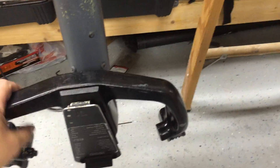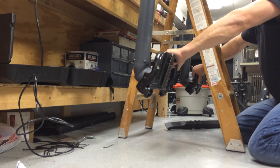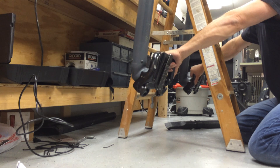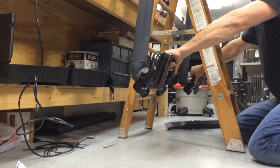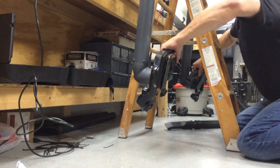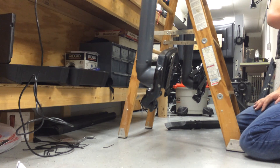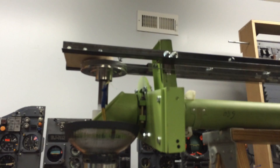The problem is I can still get these things to go off kilter. If I take the yokes and push them together inward, it's going against the coils, so the coils want to tighten in this direction — they're pretty strong. But if I go outward, I get immediate slippage, as you can see. And you can't put them back in; it won't go against the cable. So I'd have to loosen that back up. The winding still doesn't hold well on the cable.